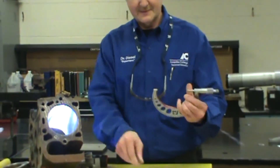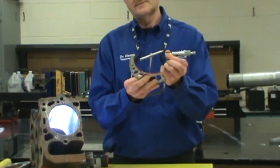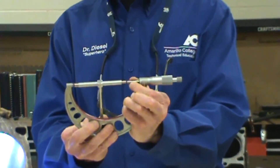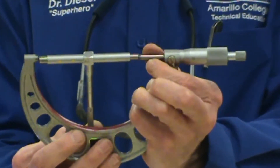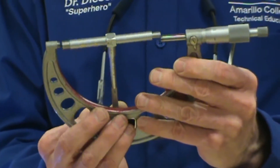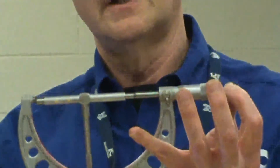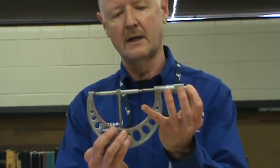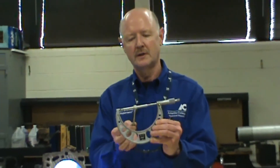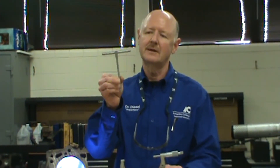What I'm wanting to show you here is to use these two fingers to turn the 4-to-5-inch micrometer to run it just up to it so it just touches, and then remove it and read your measurement. The common mistake that students make on a continuous basis is they use the ratchet part of the micrometer until they hear a little click. There's enough torque multiplication in these fine threads that it will push your telescoping gauge in just slightly enough to give you a wrong reading.